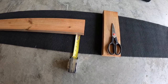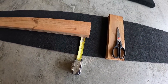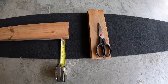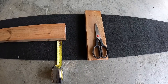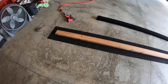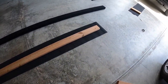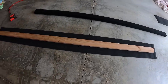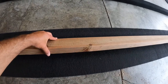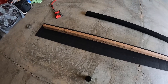This carpet comes 12 inches wide, so if you place a 2x4 in the middle of it, it's four and a quarter on each side. Then I'm going to measure four inches down and cut it so we can wrap it around the bottom of the 2x4. Once I have it all cut out and ready to go, I make sure that the 2x4 is in the middle — four and a quarter on each side. I just put it up on its side so I know where the center is.